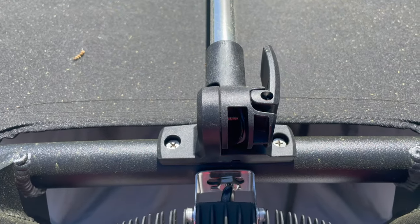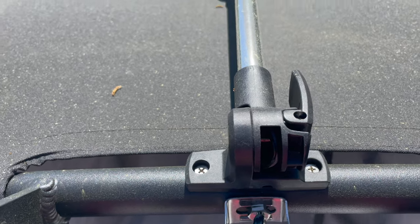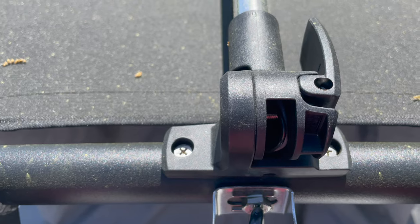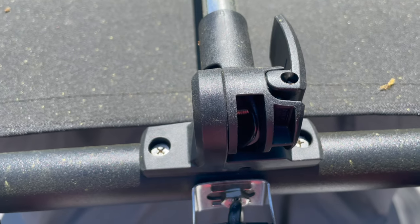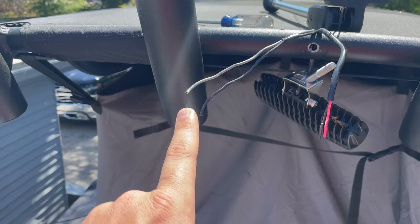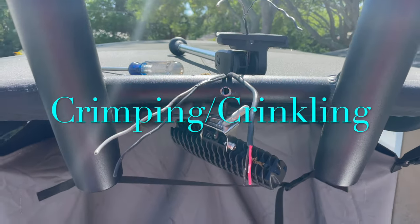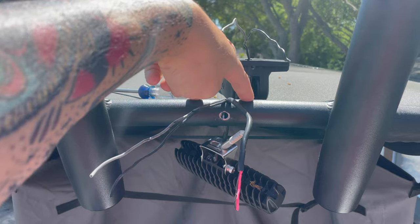The first thing you're going to need to do is disassemble or unmount the navigation light on front. Be sure not to damage the wires running up to the navigation light — they will go down through the center of the mount and you'll have plenty of slack to pull out once you've unmounted the two screws on the top side. Once you get it all taken apart, inspect your wiring. They leave a lot of slack on the line so you'll see some crumpling in the wires. Just make sure there are no nicks or cuts from removal or installation.